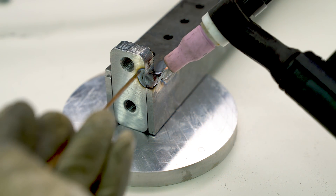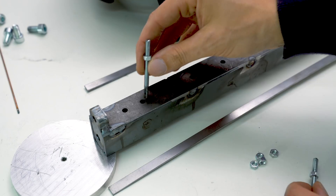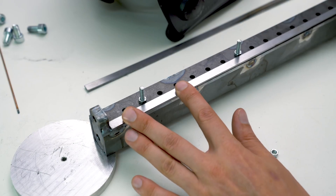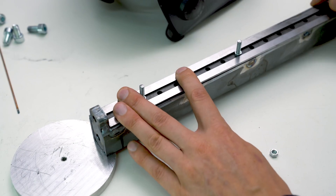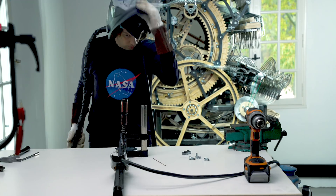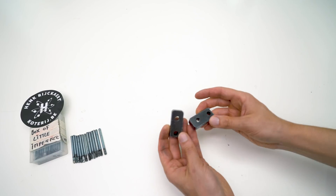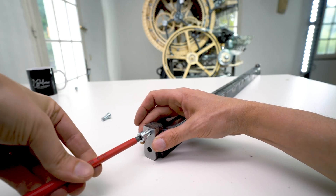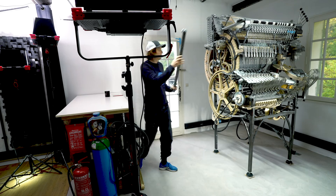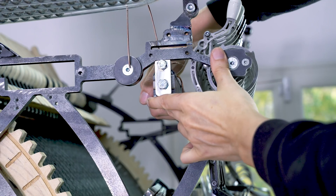Now we come to the part of this design that I think is pretty elegant, simple and functional. These two top strips of metal will retain the nut from rotating, which makes for very simple and secure spring tensioning adjustment. These two side pieces will actually become a part of the frame of the Marble Machine X. I need this bolt connection because the two side frames are not meant to be welded together — I need to keep the two side frames removable.